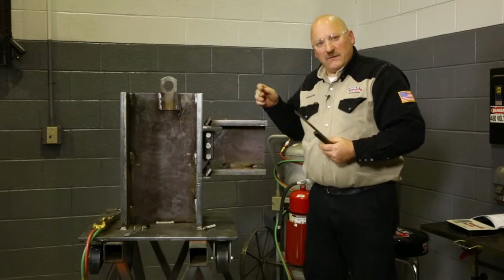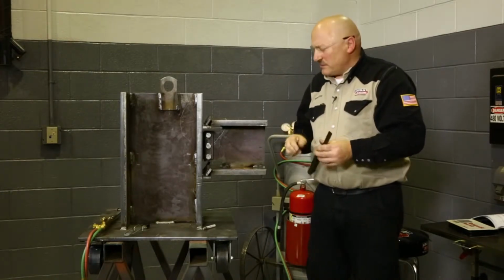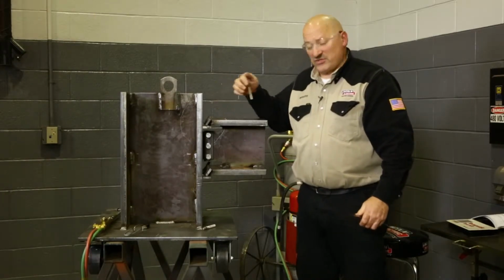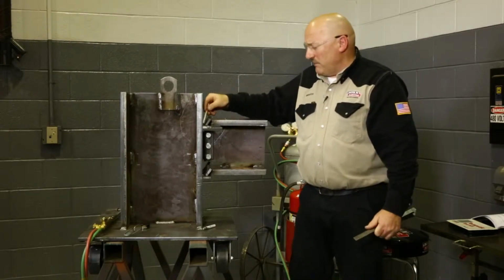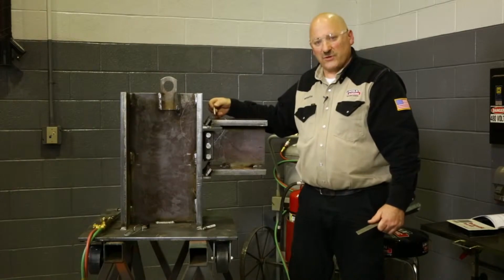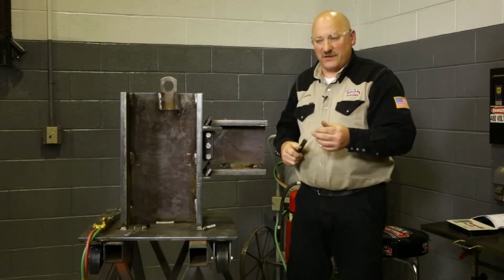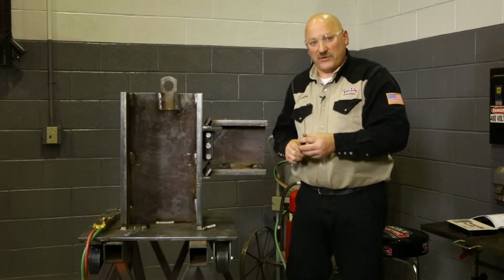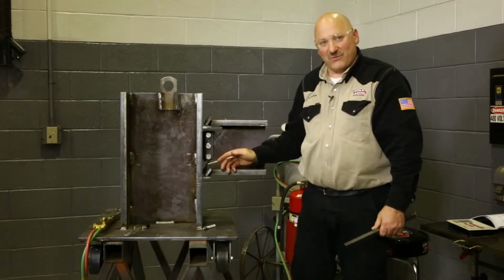Now, I'm going to mention again, earlier I mentioned that this would be welded with a low hydrogen process. Typically, high-rise construction on a big building, they would use a semi-automatic process like self-shielded flux core. And the flat position T-joint here, which is a bevel groove joint, would be welded with a 70 T6 wire, such as a NR 305, usually a 5/64 or 3/32 size. That would be the fastest way to weld these flat position welds.